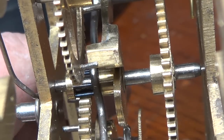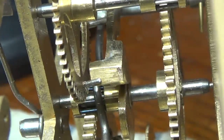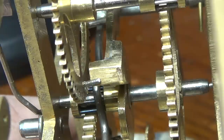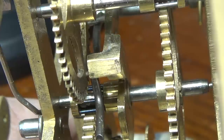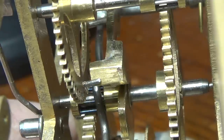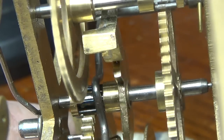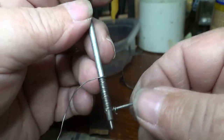I wonder if I can adjust that just a little bit more. Okay, now let's watch that pin again. Put some leverage on that. Turn that minute hand. And we'll see the loop come up. Goes into warning. There we go. And run till it comes back around. Warning. Run. Good. Okay, here was another problem I found.